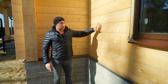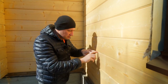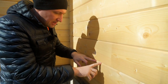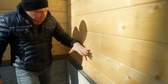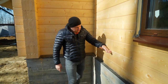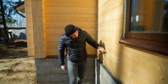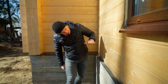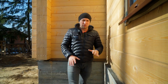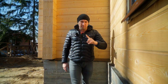When preparing the exterior walls, it's not only the flat surface we're going to sand, but also these grooves. You should know that these grooves are the most vulnerable — they will gather particles and dust, sun rays can get in, and water as well. So it's absolutely necessary to get both planes of the groove sanded. This flat part of the wall is really easy to do, but every groove should be sanded and painted.